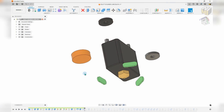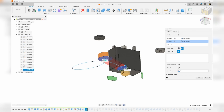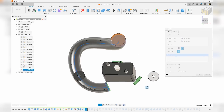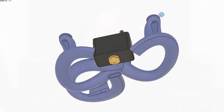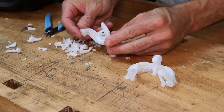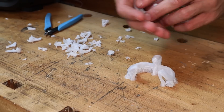To make our own versions we just need some way to get the air from the hose to the mouth gradually, and some way to mount it. I've created a sketch for the mouth of the ducts and then lofted from the hose side to the mouth along a center line, done that a couple more times, combined the parts together, and then hollowed the shape out. I've also lofted some sturdy mounting points so it's nice and stable on the printer. After removing the supports, these turned out really well, especially since they only have a 0.7 millimeter wall thickness.